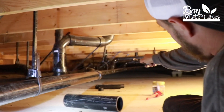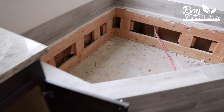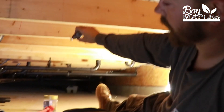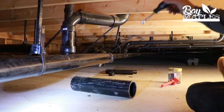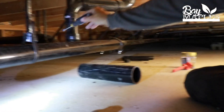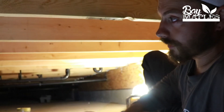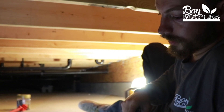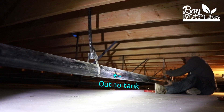We have our sink and shower for one of the hallway bathrooms right there, and just beyond that is our laundry and the jacuzzi tub for the master. Further down we have another sink and shower pickup. That's coming into our first line, which starts at the hallway half bath, picking up the bathroom sink there. We capped all the spots where it was originally going straight to sewage, ran our own line straight alongside the original sewage line, then chopped the connections where we had the gray water coming out. That's where it ties back into the sewage if they want to divert it — otherwise it goes out the perimeter wall and into the gray water tank.